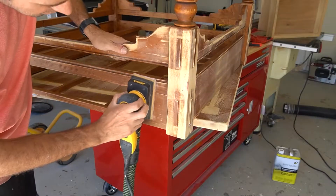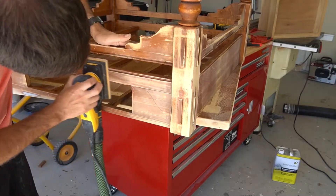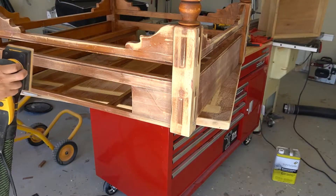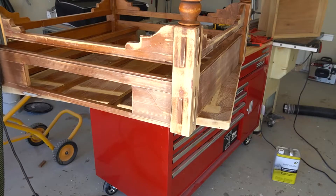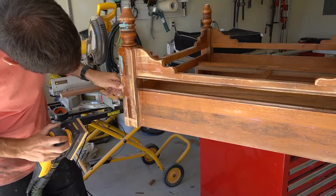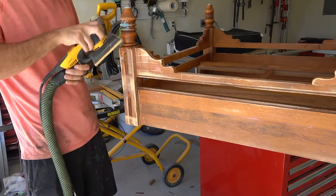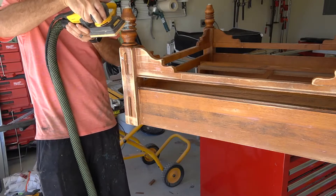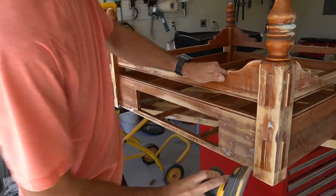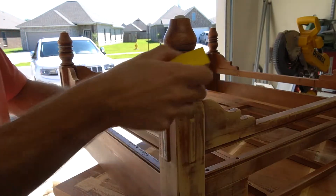What you see me doing now is just preparing it for paint. It had no wax on it — it was just a clear coat — so I started sanding it. I sanded off a lot of the old finish on the tabletop, a little bit less on the base, but still a good bit because I had to bondo so many little dings and nicks from the years, and also due to the natural character of the wood that I didn't think would have looked good with a painted surface. I'm sanding down all that bondo, sanding the spindles and everything like that.